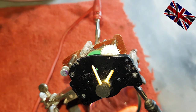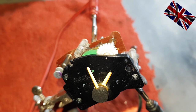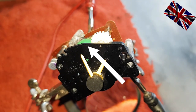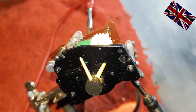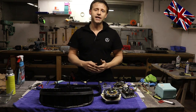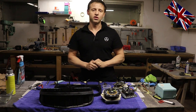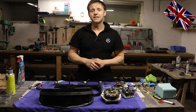See this? Watch the green cogwheel moving to the left, so both capacitors and resistors were shot. As mentioned before, capacitors and resistors were all shot. When testing the clock for functioning, never use your car battery, but an external power unit with 12 volt.